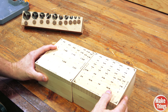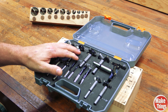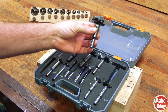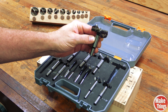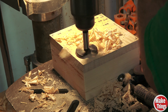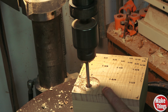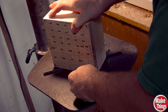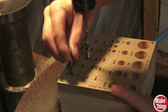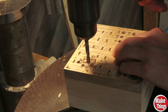With both blocks done, it's time to drill each hole out. But before you do, you'll obviously want to have a complete set to work with. I bought this carbide Forstner bit set off Amazon for less than about $60 and it has pretty much every size I've ever used. Next, I strategically drilled each of the holes by first drilling the larger holes before drilling the shaft holes - of course, this was just for the Forstner and spade bits. For the brad point bits, I used the larger size up for each of the holes. If you don't do this, your bits will stick, so I recommend getting a set of brad point bits that are a 64th away from each other.